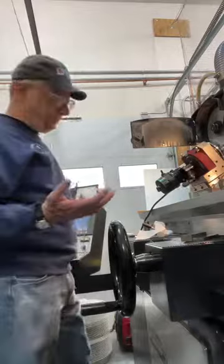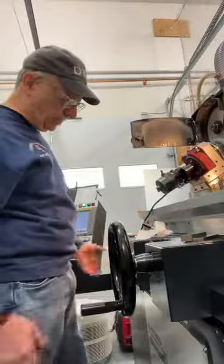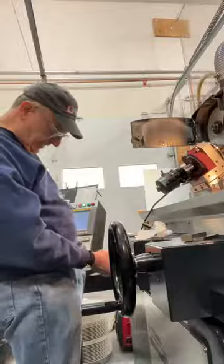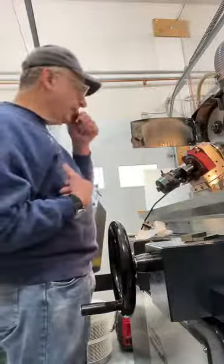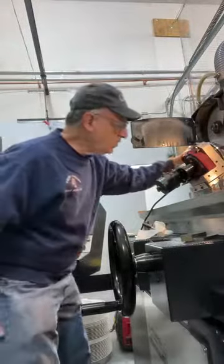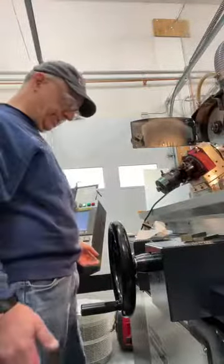So I'm pretty close. So I'm going to switch to very fine mode. So again, this is 10 millionths a click on this hand wheel. And the infeed, the Z-axis hand wheel, is left on 0.02 per click. And that's just for traversing the tool. The only thing that might hit here is my coolant nozzle. So I'm just going to spin that out of the way. Everything looks good. So here we go.